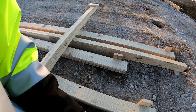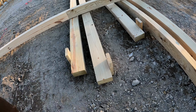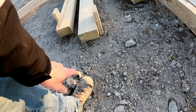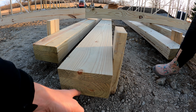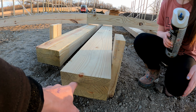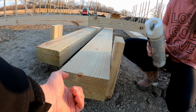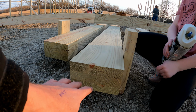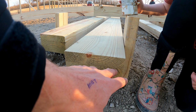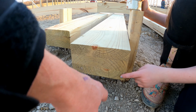But the benefit you get with the pressure treated portion of this is that, as opposed to if it were a 4x8, when they pressure treat it, you only get certain penetration all the way around. Well, with each of those being one little board, you get more penetration into each one of them, and probably, you know, clear through, penetration of waterproofer.